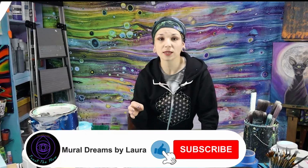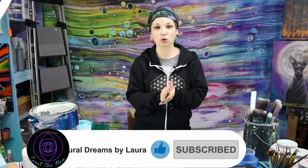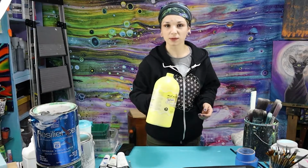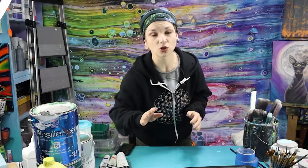Water-based paints are great because they're durable, they're washable, they have low volatile organic compounds, they come in various finishes, they're resistant to mold, to fungus, and they're flexible, so that means they don't crack. Sometimes enamel paints or oil paints will crack with time and they'll yellow. Well, these don't. Also for the bigger projects, sometimes I use the really big economy paints, especially for my house since I paint over so much. We're gonna paint a mural at the end of this series.